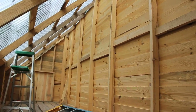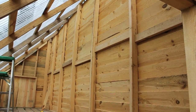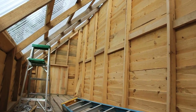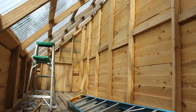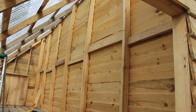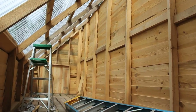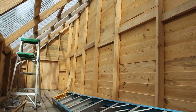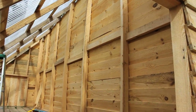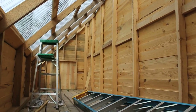I'm only going to put two fans in here — one on each side. The reason is that the original design I based this off of is a 10-foot wide kiln, and he had only one fan. This is a 20-foot wide kiln, so if one fan works for one stack of lumber in a 10-foot kiln, two fans should work fine for two stacks in a 20-foot kiln. If it doesn't work, we can always update it later.